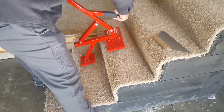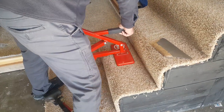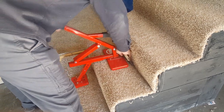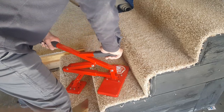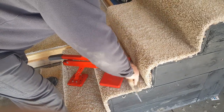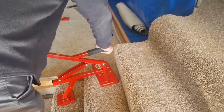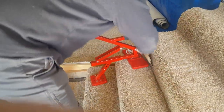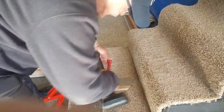Alright, it's real easy. As you can see on it, it's got six little holes for adjusting, so it'll adjust to any size stairs. These happen to be the stairs that go up into our office. Everyone's going to stretch carpet differently. As you can see what Mario's doing right now, on each side he's turning it at an angle. But you're going to do it any way you want. Our stretchers aren't built to be used one way. The main thing is they do stretch and they don't slip.